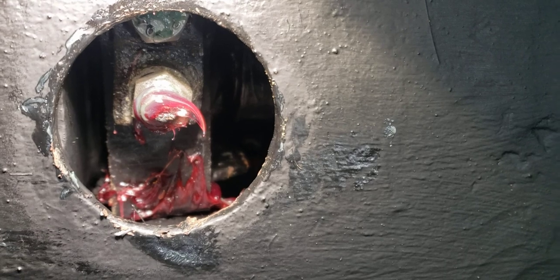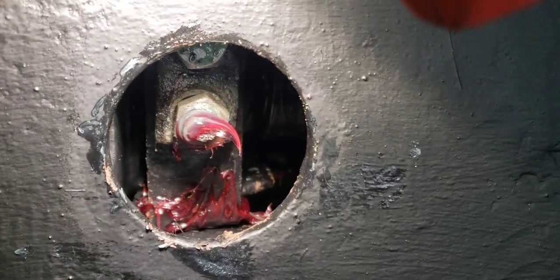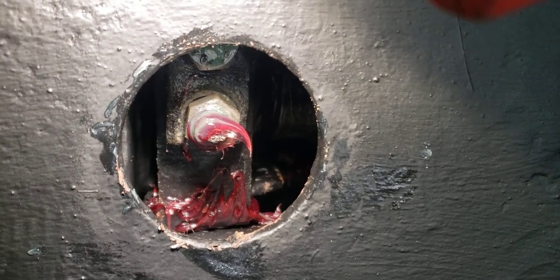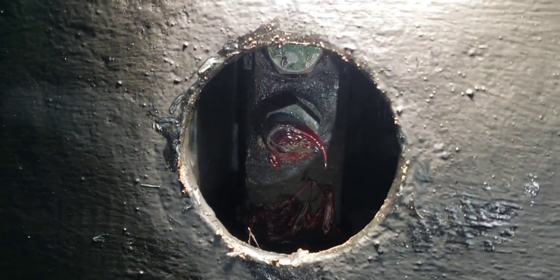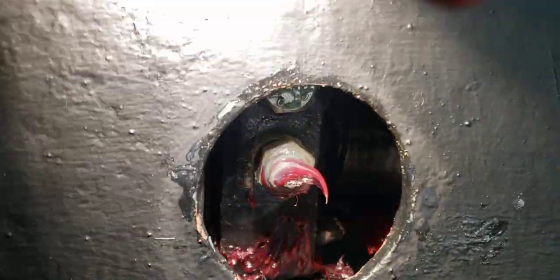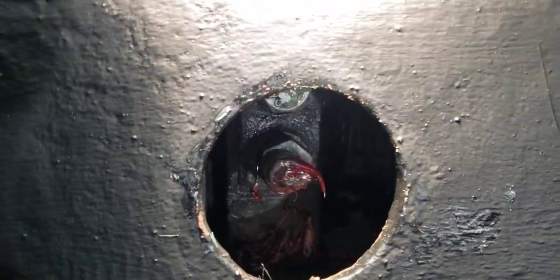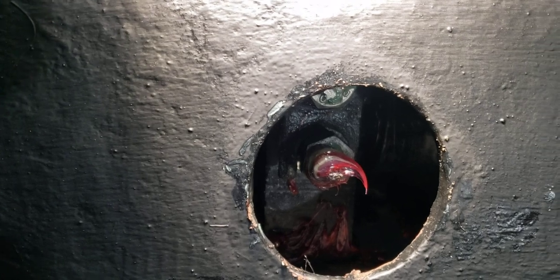But right there, what happened was the piston had to be moved. It was kind of cocked, so I had to basically move that so it would slide into the carriage there. So it's all the way back. You can tell the piston's all the way back hitting the frame, and there is no piston out, because when we put the track on, we'll pump it up with grease. And that will basically expand the idler roller and make the track tension tighter.